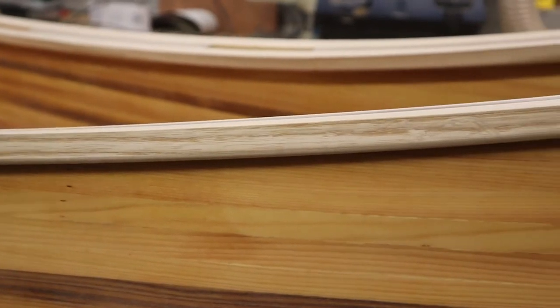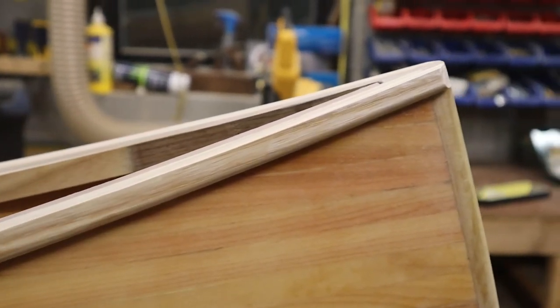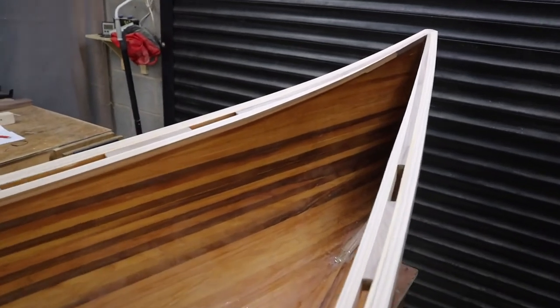I've tapered the gunnels towards the end. The bow and stern are reinforced very heavily by the decks that'll go in the next video, so you can get away with reducing the thickness of the gunnels really quite significantly there because they don't carry as much of the load.